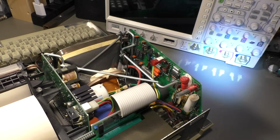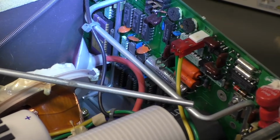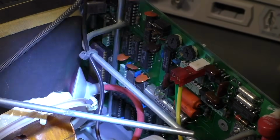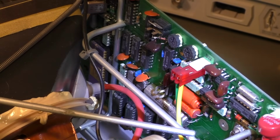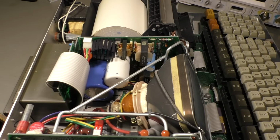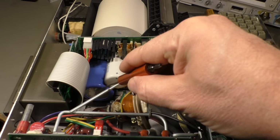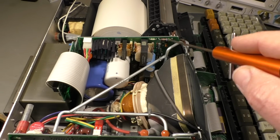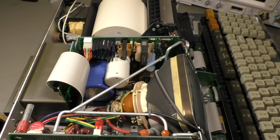The CRT controller is there, so they put that on the CRT driver board with a little bit more logic. You can see the processor there, with the golden cap. So that's the CRT board here, and the power supply board is here on the right side of the screen with some really big capacitors, smaller capacitors, and they are all original. I have never repaired that power supply, and at the moment it seems it doesn't need to be repaired.